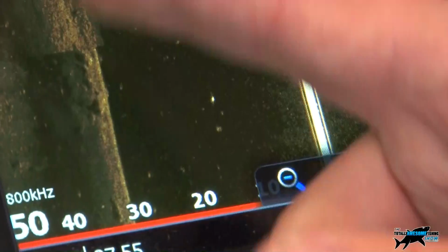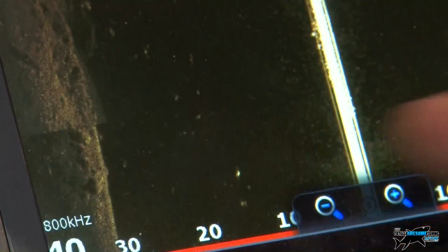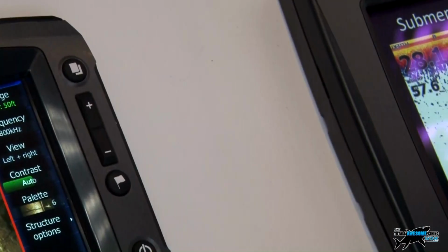So at the moment we're showing anything over here would be up to 50 or 40 feet out to your port side. Sure. And this will be up to 40, 50 feet out to your starboard side. So that allows you to work out where those items would be. That there's a 60-foot gully, 30 and 30. That's what I'm working at.